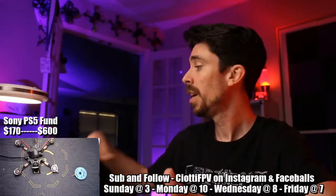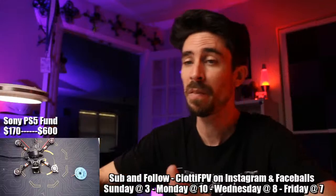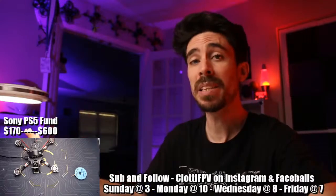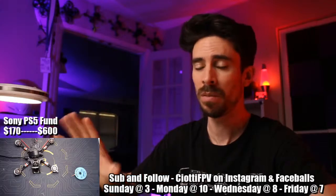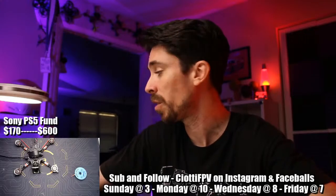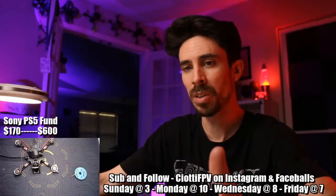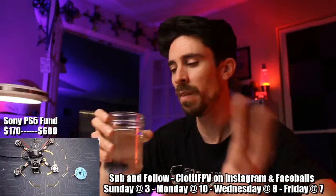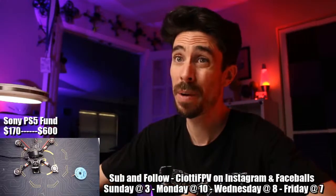It is kind of nice to have one or two 5-volt pads that give 5-volt when you're plugged into USB, so that you can power up your receiver and not have to plug your battery in when you're looking at your receiver in Betaflight. But I think I would actually rather have it set up like this so that you never have that odd-even numbered UART thing with not going into DFU mode. So maybe they'll start setting flight controllers up like this from now on, because that's a really annoying issue to have to think about when you're building a board. Like, oh, this is a receiver that's powered, I need to get this on an even UART, not an odd UART. It's also a problem that not many people know about.